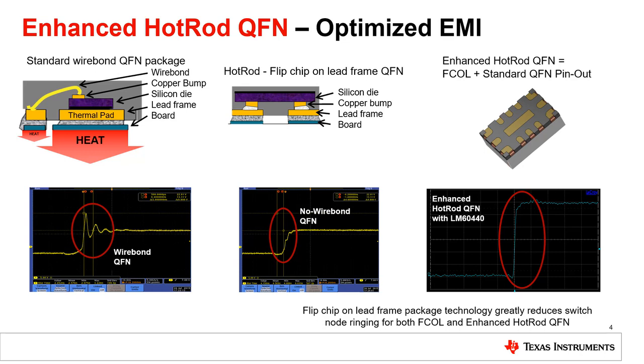But Hot Rod flipped the chip so we no longer have a thermal pad. Heat instead flows through the pins to the rest of the board. This isn't an issue since the pins have a much higher thermal conductivity than pins which connect with bond wire. Connecting the ground pins to the ground plane typically provides good thermal performance, but this isn't always practiced since engineers are used to using thermal pads.